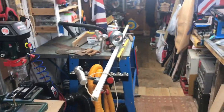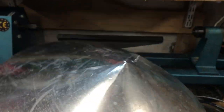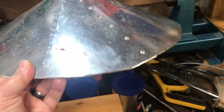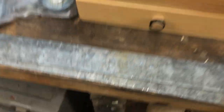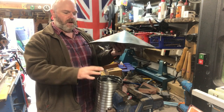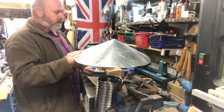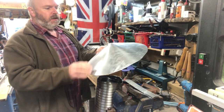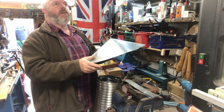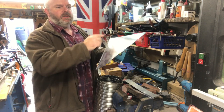This workshop's a right mess, look. I've made this, which is just a bit of galvanized metal - it's only rough because it's going to be stuck right up in there. So I'm making a cap or a cowl that goes up on the top, and I've got some pieces there to fit to it. The idea is to make a cowl to keep the rain out the top. I made this a few days ago - it's just a flat piece of galvanized steel, made just a little bit smaller than the size of a dustbin lid and then roughly cut out with some tin snips.